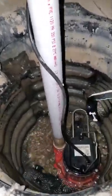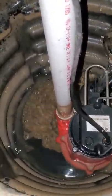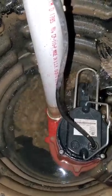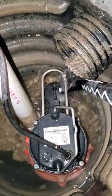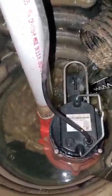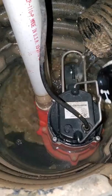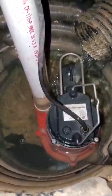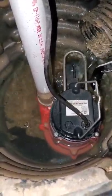The black ball you can see here is actually a float switch. This black plastic piece is a switch — as water fills the sump pit, it lifts that plastic up until it touches this bar. Once it touches the bar, it switches the sump pump on and the pump begins to pump the water out. Sometimes this float switch gets stuck.